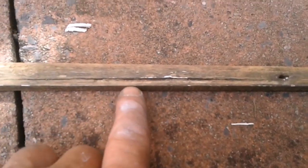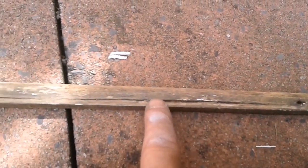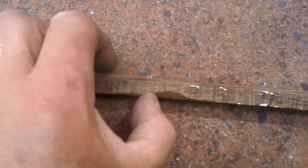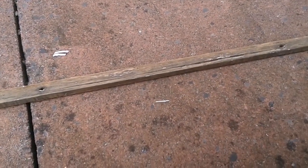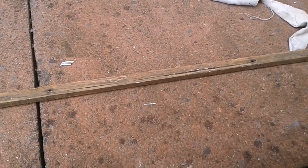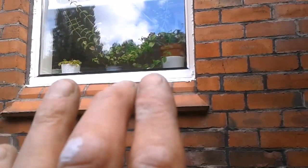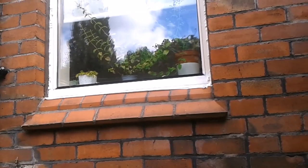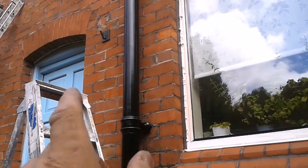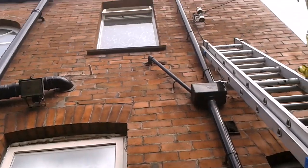The bead I've took off has dried, but that split running along here with rot in it, and here rot. So overall it's not too bad, but it's quicker and easier for me to just prime up a piece, fresh piece, and put it in. So I've got one cut, that's drying, that can go in. When a lot of that foam has dried back and I've cut back, so I'll probably start doing some pointing around the doors. Finish off a little bit of filling up there.